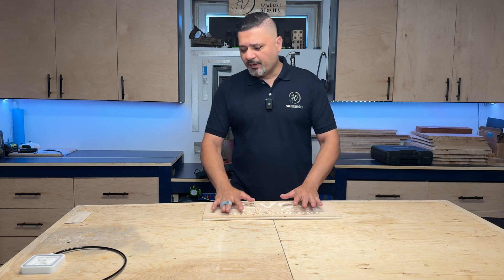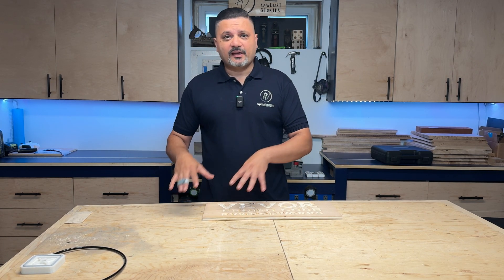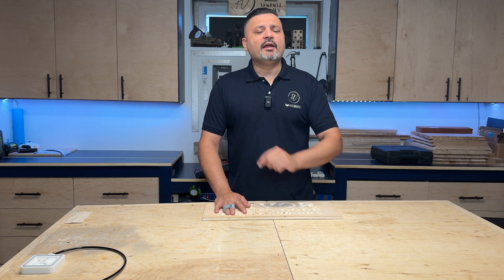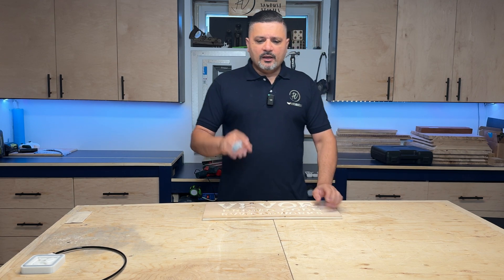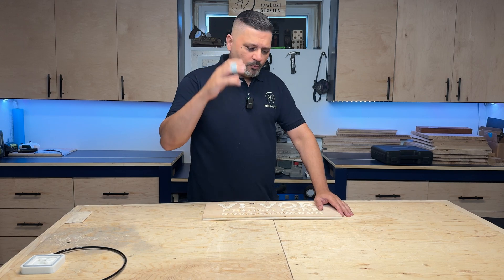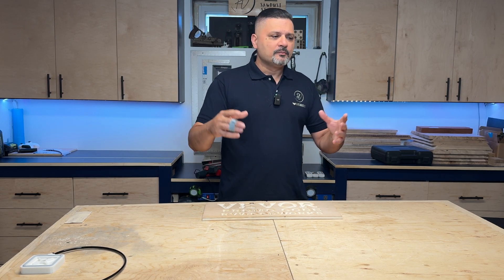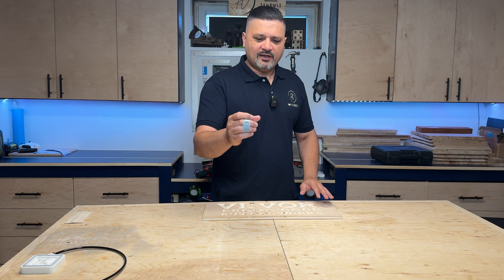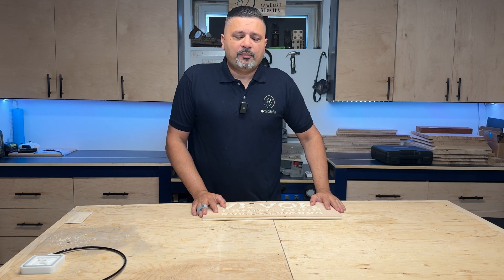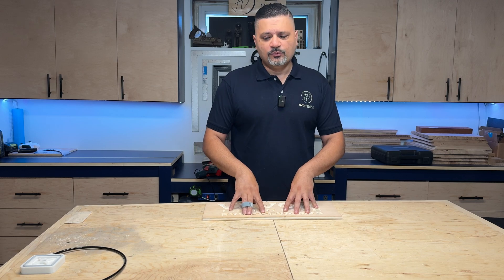What's really interesting about this vacuum pump is that it is easy to set up and holds the workpiece down phenomenally. But there's one small thing to be mindful of when purchasing: it does release a level of mist into the air because of the oil. When suction occurs, the oil mist tends to come up quite a lot. I found a relatively cheap solution by routing a pipe out the window so there's no smoke in the shop — but I want you to be aware of that, because my opinion is my own and I want to be honest.